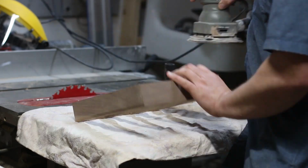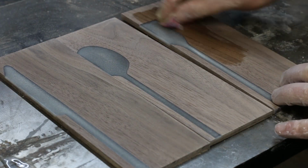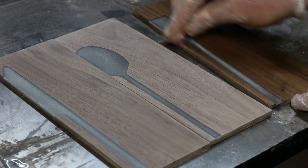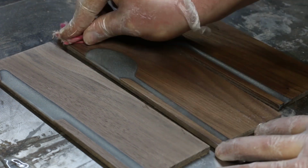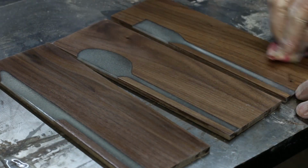After I was done with the glue-up on the frame, I applied finish, and I used Osmo Polyx oil. Although this is a really good finish, if I were to do it again, I would use a polyurethane, as I think it would wear better in the long term.